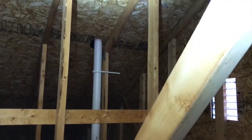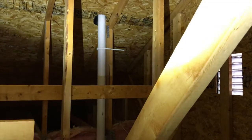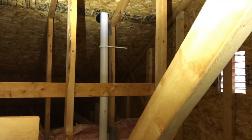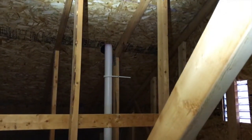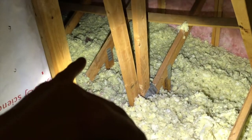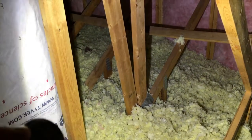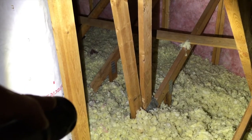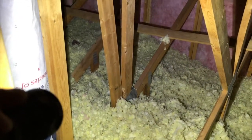An active system will have a fan installed at this very point along the plumbing, which enhances the suction of the radon gas from down below through the plumbing and out the top. I'll carefully get down and go outside to show you the exhaust pipe. Also, prior to leaving up here, right over there is our access point from the walk-in closet and the entire cap is covered with insulation. So do take that into consideration when pushing your cap up and shifting it to the side — you may have to move a bunch of insulation.